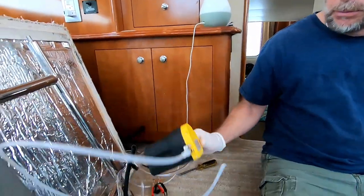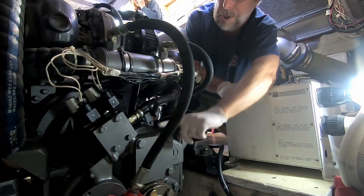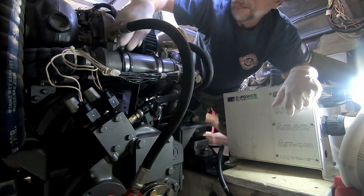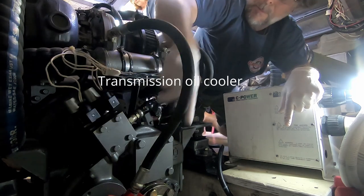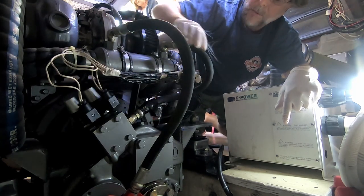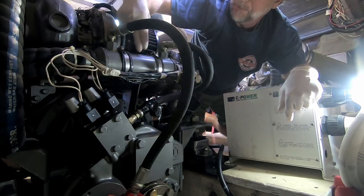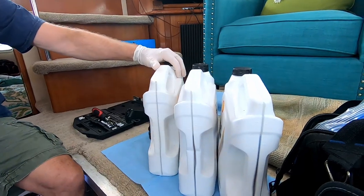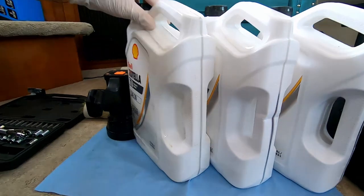What I'm doing right now is I've got a little 12-volt pump and I'm going to pump out the oil that's in the transmission. I'm learning as I go, so I might seem a little slow. This is the transmission cylinder right here, this is the transmission cooler. The oil comes up from the pump into the cooler, gets cooled by seawater, then the oil goes back into the transmission — it's just a little closed loop system. This is the piece I'm going to replace. I've got the Rotella SAE 30 which is the recommended oil for the transmission.